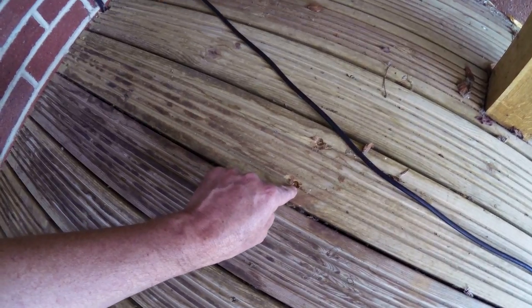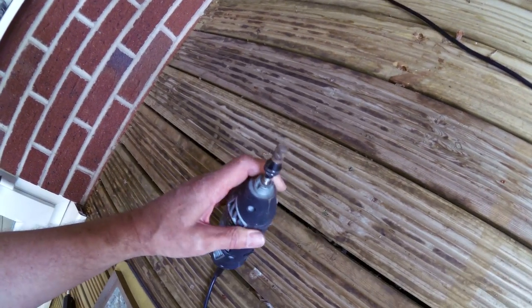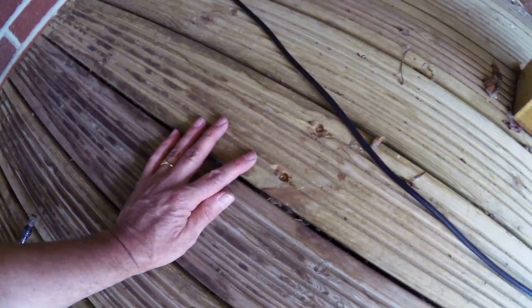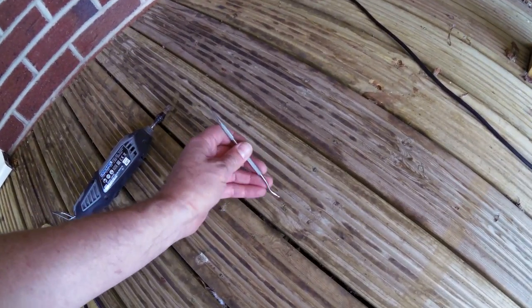to take the Dremel down to the head of the screw till the abrasive tool just polishes — here's the tool itself, look — the top of the tool here, the abrasive tool, just polishes the top of the screw. And then what you're able to do is use perhaps a dental pick, something like this, to pick out the top of the screw.